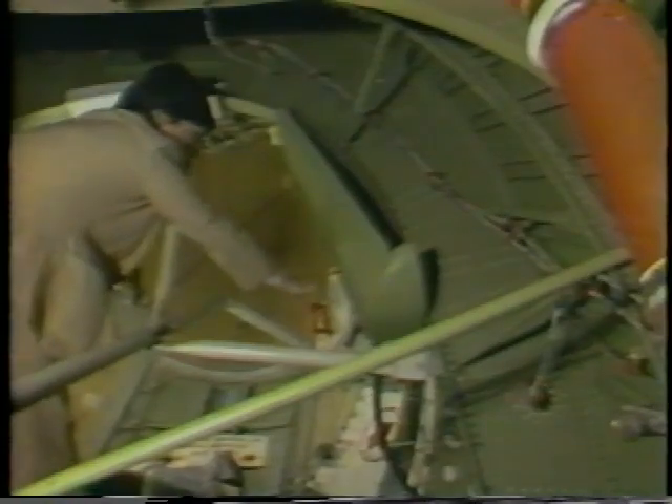If the tail cone does not jettison when the emergency door handle is used to open the aft passenger door, there is a backup jettison handle. It is located on your right side facing aft at the end of the walkway. Grasp the red release handle and pull hard.